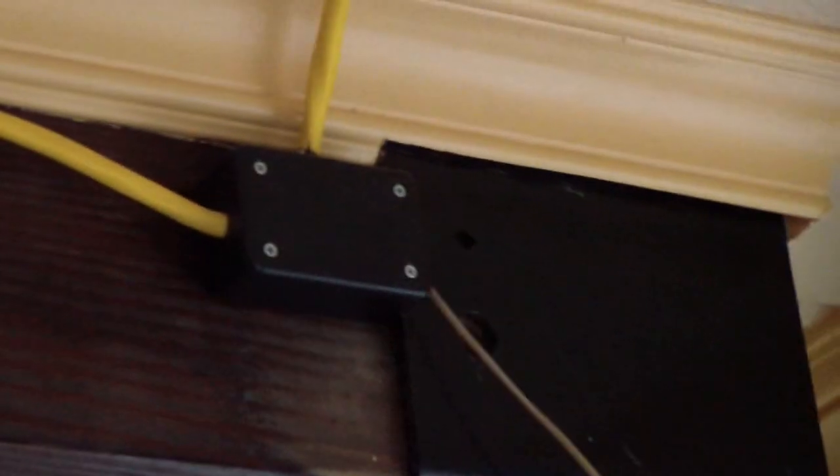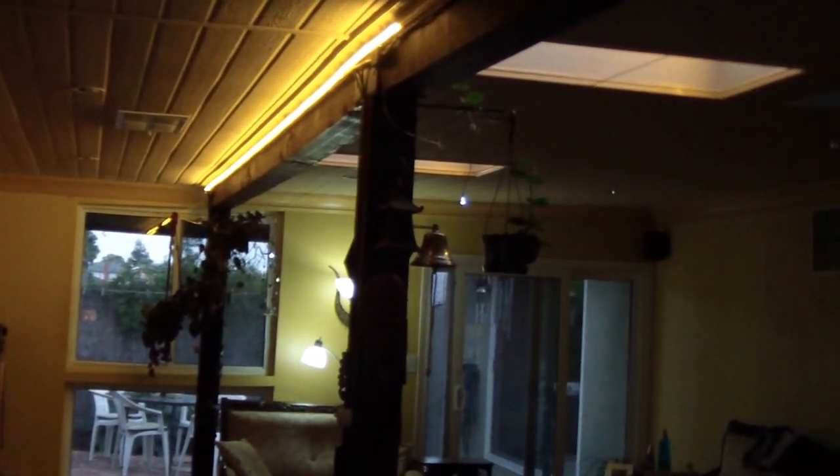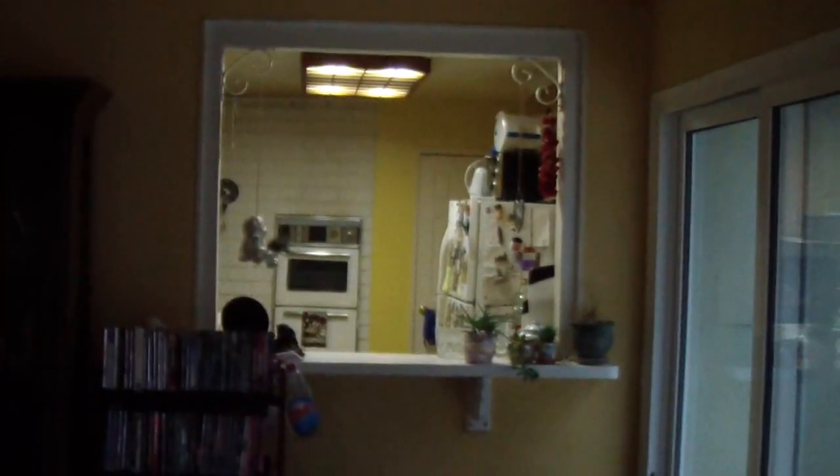I use 12x3 wire — they say three but there are four wires including the ground. I just use two wires; there are four wires that bring the power to that junction box. It's a makeshift junction box — it was a kit project box from Radio Shack that I converted. It runs all the way to the end of the room to those lights at the end. The total draw on all these lights together is less than three amps when they are running.